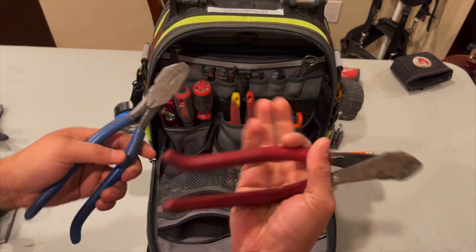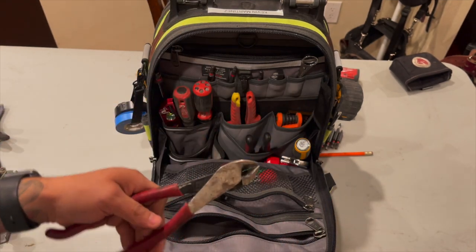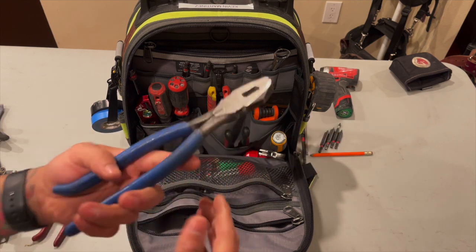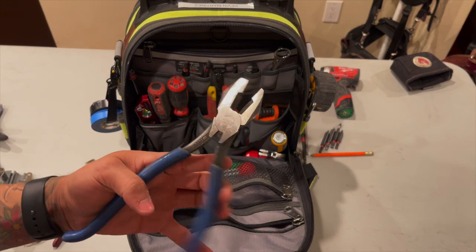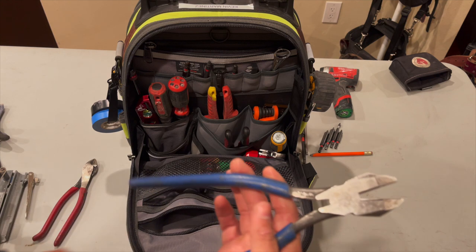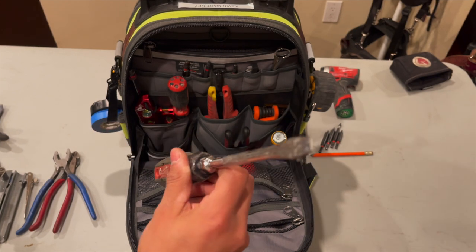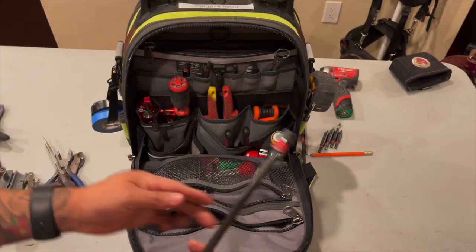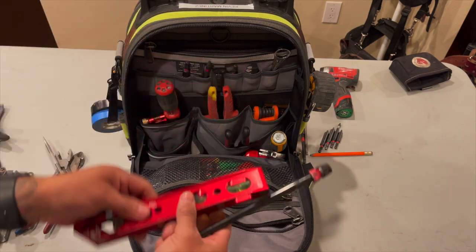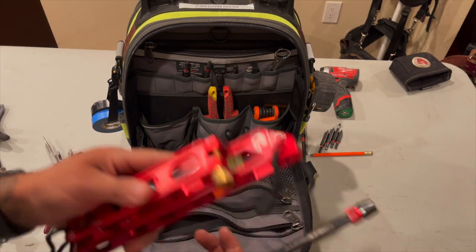Some of the deck tools - I had to go with Klein. These deck snips have a little handle for when you're cutting where you push it - they're pretty long. I've used these when doing decks on the high rise, they're pretty sharp and pretty nice. Great when you're working with rebar and tie wire - tying anything like that. The head is spring loaded. I got really comfortable using these on the decks or when doing underground, just tying conduits. I also use my Milwaukee beater or flathead - I was using it on decks before. Pretty beat up but useful when doing layout because you don't have to kneel all the way down to screw your boxes into the deck. I also threw in extra levels by Kapro - they sent these to me a while back, I figured I'd throw them in just in case I need them for the decks.